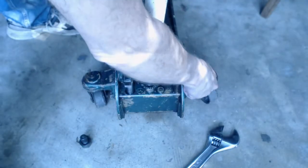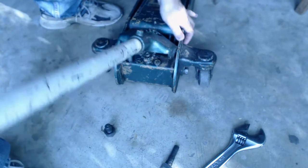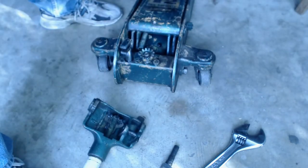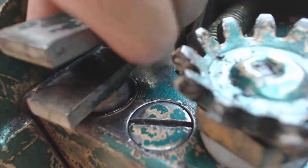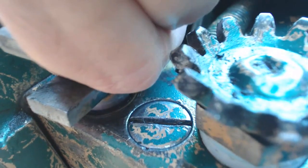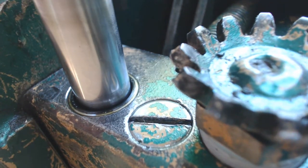Now when you're removing the handle, you're going to notice there's a little pin that goes in there. It engages the top of the actuator. It's got a flat spot on it, and to be honest, I've never been able to tell which is best - the flat spot up or the flat spot down when you put the jack back together. Now it's time to remove the actuation plunger. Pull straight up. You definitely should feel some friction - it should give you some resistance. If it's really, really loose and just comes out without any pull at all, that may be an indication that your o-rings or seals are in poor condition.